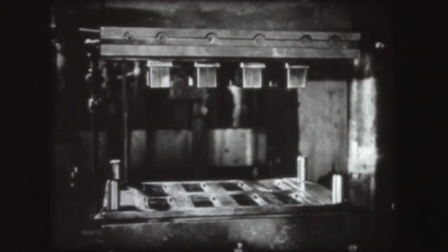A multiple cavity mold which has been constructed to exact dimensions out of the finest die steel is used to mold the parts. One half of the mold consists of the cavities which form the outside of the pieces to be molded. The other half conforms to the inside shapes of the pieces to be molded. In this case, 8 pieces can be molded at once.